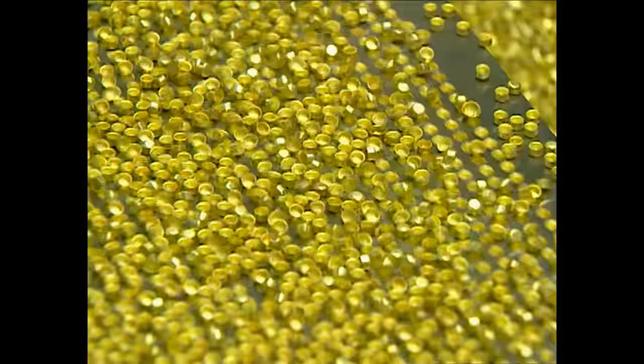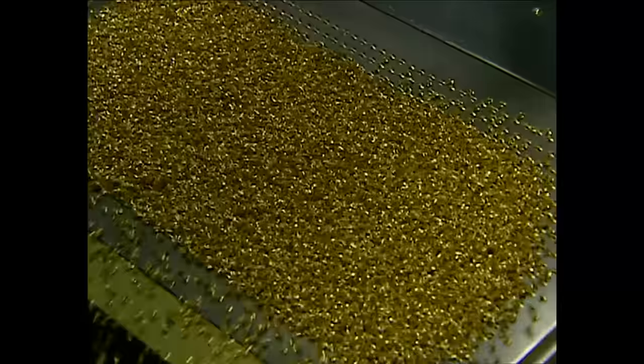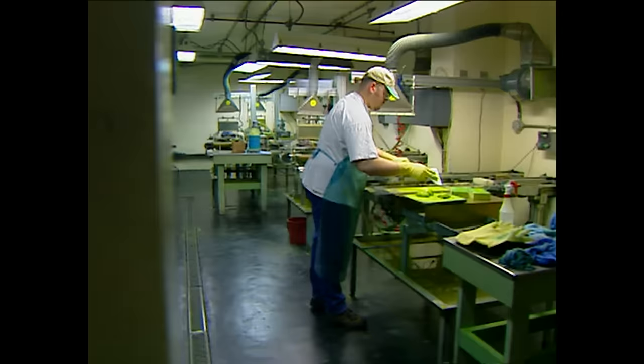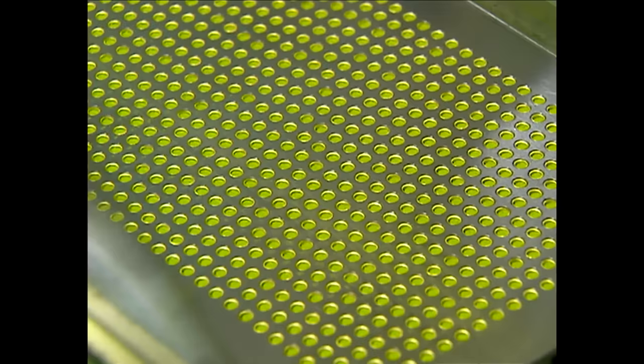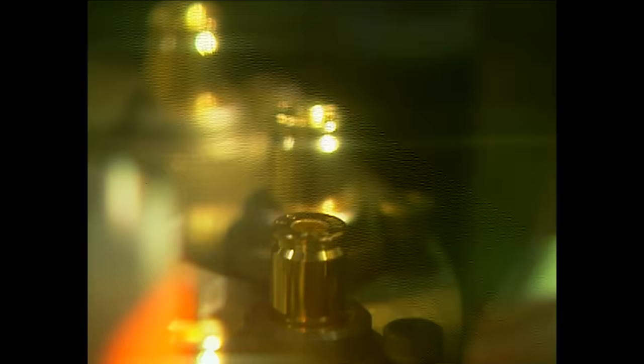But we don't have primers. Federal needs millions of these each year, so they're made a thousand at a time in trays with the cups loaded by vibration. And the anvils, the inner structure, also filling their own plates. The cups ride outside the main building into a block house where Sean Fitzsimmons is doing the charging, standing in water on an anti-static mat. He rubs the ball of primer material into a plate of holes that precisely measures the material before flipping it over to be pressed into the cups. While it stays wet, the primer compound is relatively inert, but not entirely, so static electricity is a danger here. Back inside, the plate of cups mates up with a plate of anvils before being unloaded and inspected and sent to build a cartridge. Priming is done separately here, and rapidly, as the cases are punched for the flash hole before the primer is pressed in.